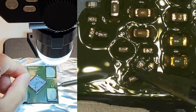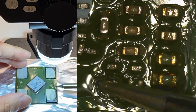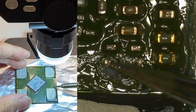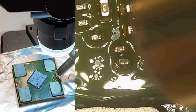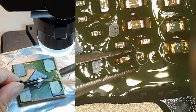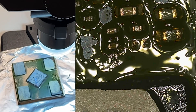First, apply brand new solder to the pads to make soldering easier. It's my first time soldering such a small cap — my hand is shaking like crazy. Use hot air to solder the caps back. I use the weakest air flow I can set on my hot air station; otherwise, the cap will just fly away. Let's align it a little bit more. Perfect. Let's move on to the next one. Wait, where's the other cap? It was right there, but it's now gone.